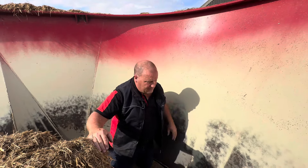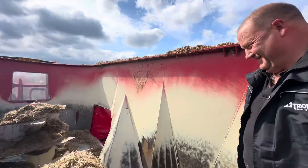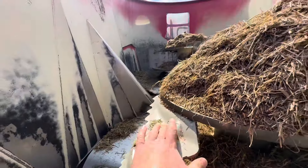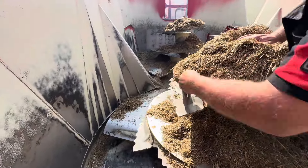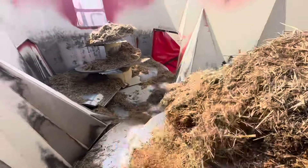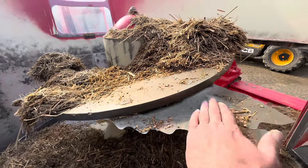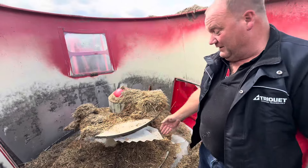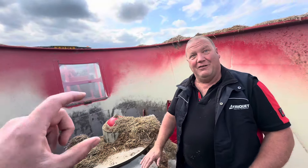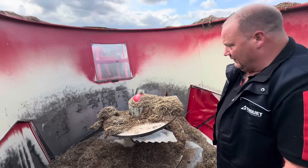Those are the cranked blades — sorry, we don't call them that, do we — crank knives. It's got a thickening effect. If you look, there's a raised section where the bolts go through that keeps tension on it. There's a little bit of flex. Also, because it's cranked we don't need a backing plate — everybody else tends to have an 8 mil backing plate, some even two of them on the top ones. We don't need a backing plate because the crank gives it that strength.